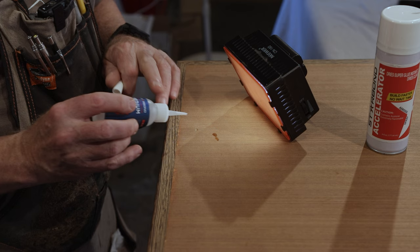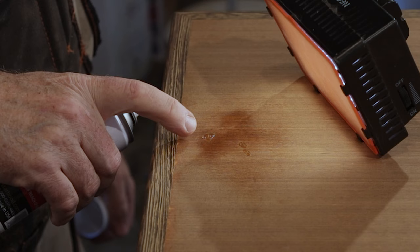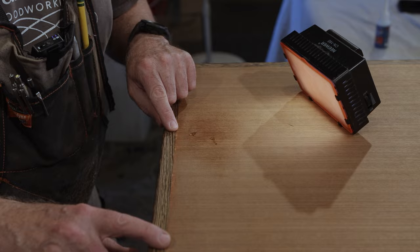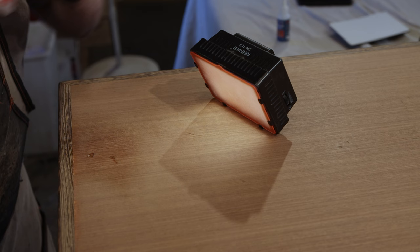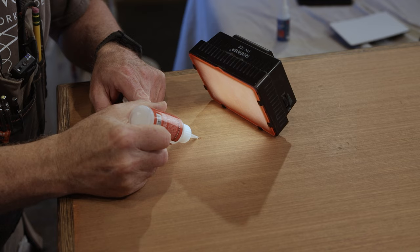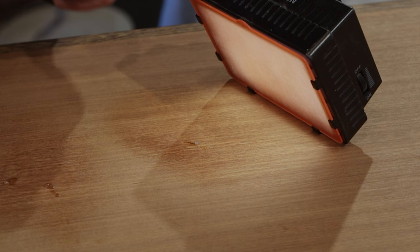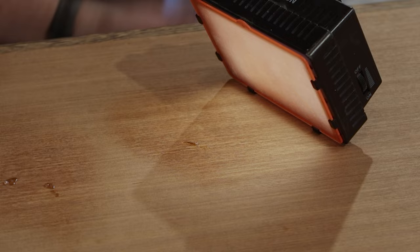Here's what we're going to do first — we're going to use the medium. So we're just going to try this on both of them. I'm going to have to get my bigger glasses on. And then we're going to take this and we'll just shoot it. See how that squirted out? It popped out right here, so we're just going to let that sit for a minute. You can see the burn-through right there — this has been sanded so many times that the veneer is super thin there. There's another big one right here. This time we're going to try the thick one. Maybe I'm putting too much activator on there — the outside is getting hard and the stuff on the inside is not getting hard, and it's pushing all the soft stuff out.